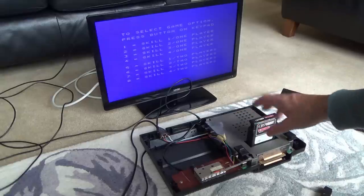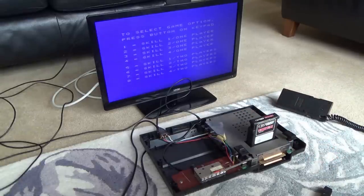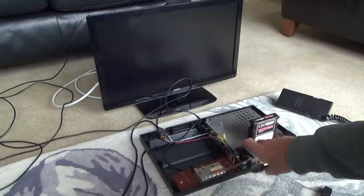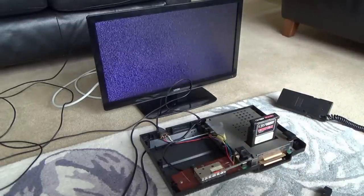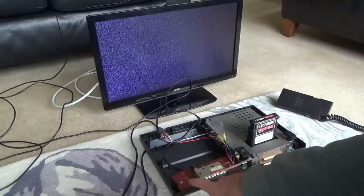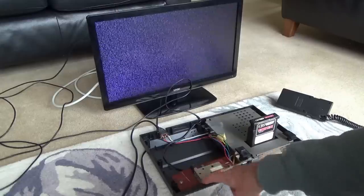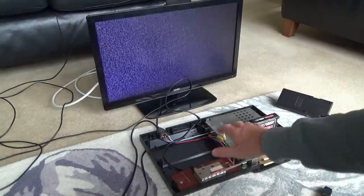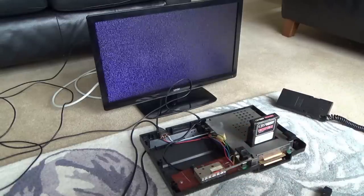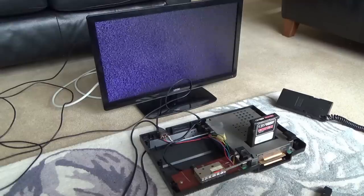So I think what's happened is when he reassembled it, that button just got a little bit stuck, so it must have been just resetting all the time. But you can see there's horrendous noise on there. How we're going to fault find this, I really don't know. If I had another one, what I would do is unsolder these wires here and put this whole module board from another one onto here. And then I'd know whether the fault's on here or in here, but I haven't got another one, so there's going to be a lot of head scratching, but I think it's going to be fun.